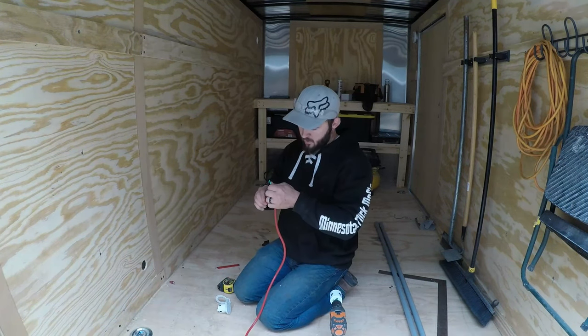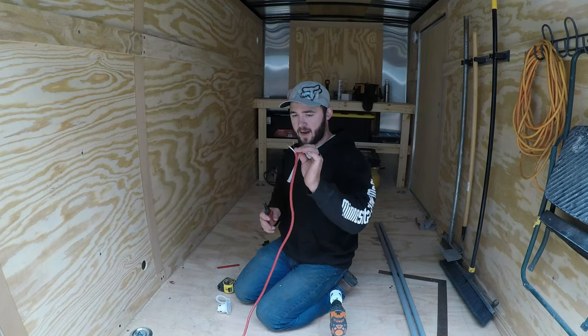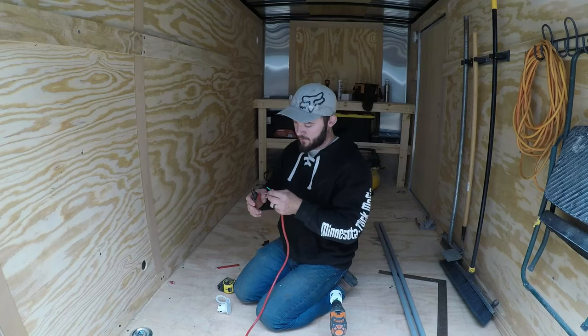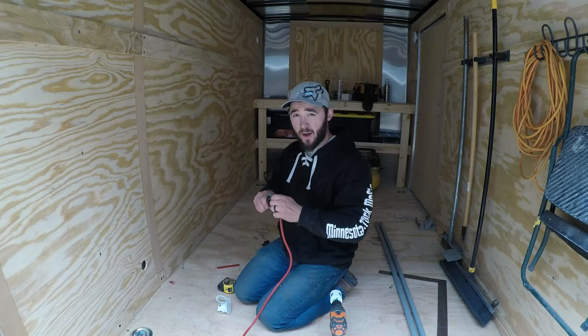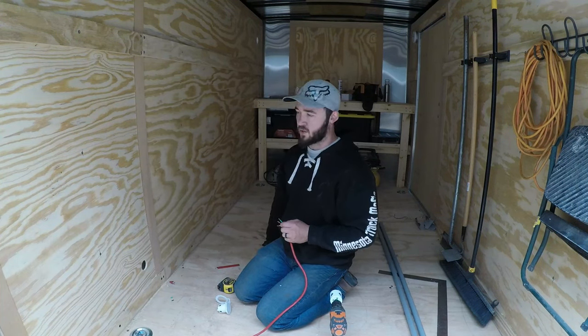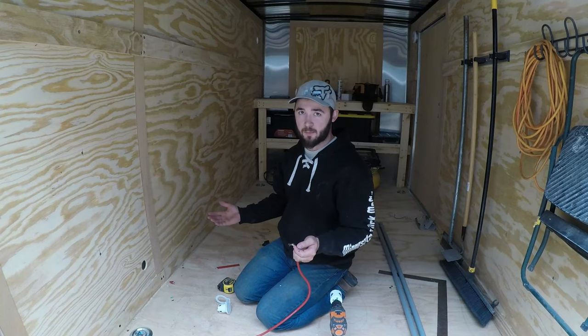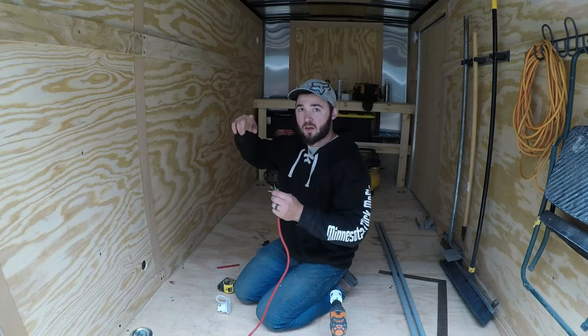The reason I got an extension cord, one, it's because they're all confined and easy to slide through your conduit, and two, most extension cords are stranded wire, not a solid wire. And when you're in any kind of a moving unit, like a fish house or a camper or a work trailer, you want to have stranded because they last a lot longer bouncing down the road.